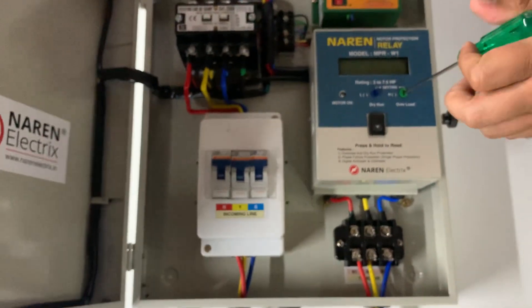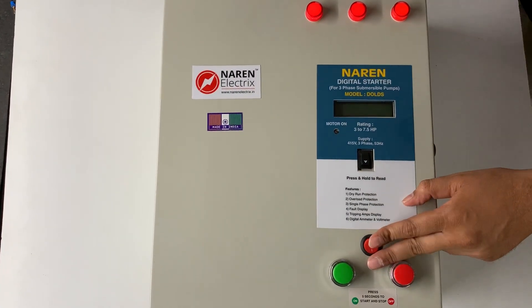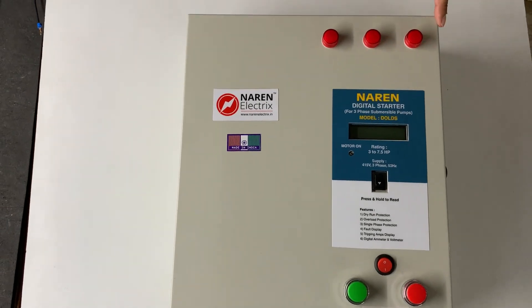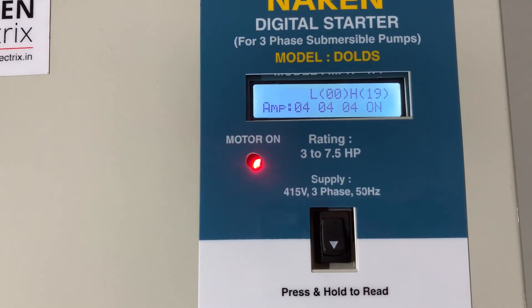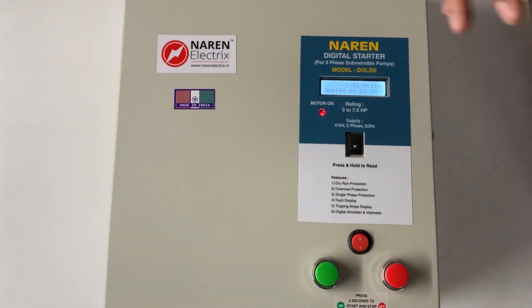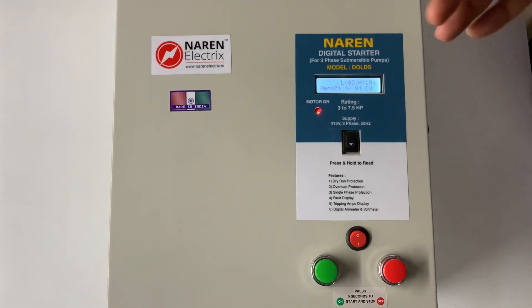We will have a look at the auto start operation. Keep the switch inside always turned on, and use the outer auto start on/off switch. To demonstrate: with power off, when power is restored, the auto start unit senses the three-phase supply for the first 10 seconds and then switches on the motor automatically. After 10 seconds, the motor automatically switched on because the auto start switch was enabled. This starter is neatly designed and well thought out to meet all the requirements of three-phase motors, with the main advantage being its customizable features.